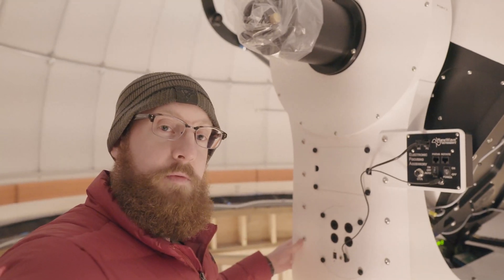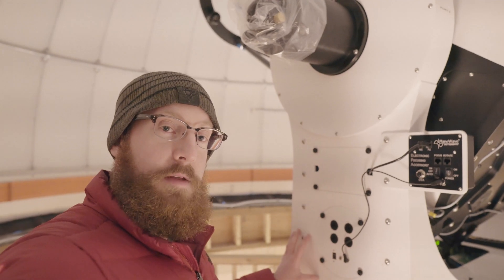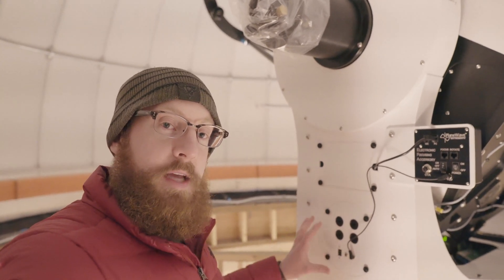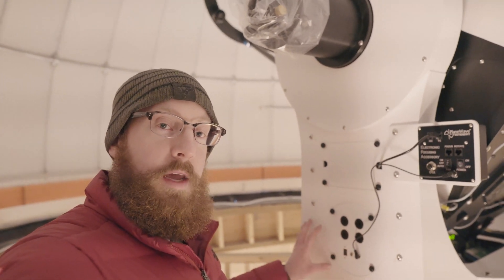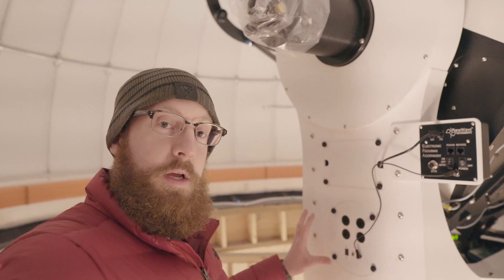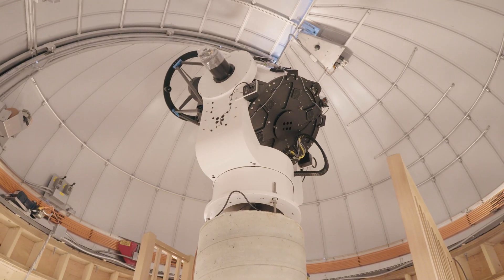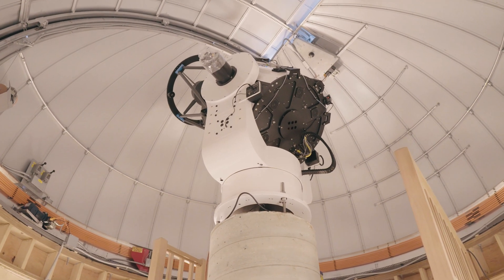I just hit the hard stop — I can feel it engaging right now. Working with my operator, I can see the hard stop was at negative 150. That means we rotated it backwards clockwise until the azimuth readout is saying negative 130. We'll enter that data into the counterclockwise limit, tracking, and go-to limits and click save. Now you can see the go-to limits and tracking are all lined up on one value, backed up safely away from the hard stops.